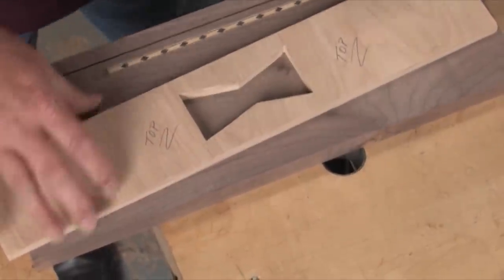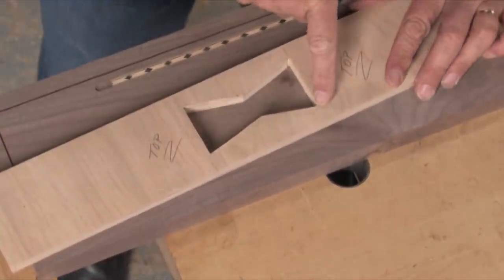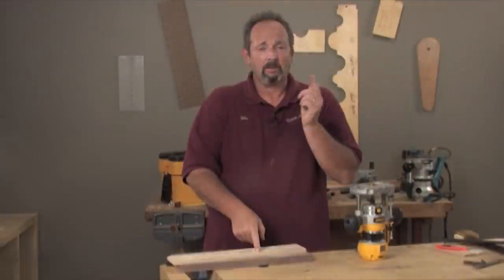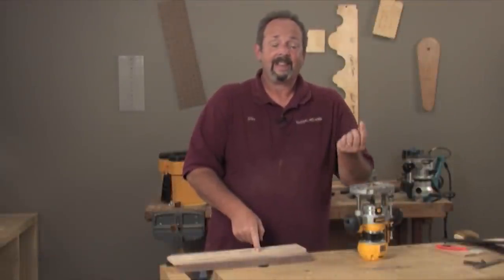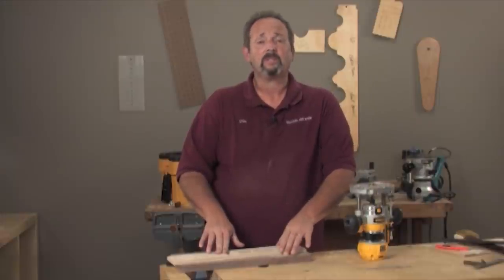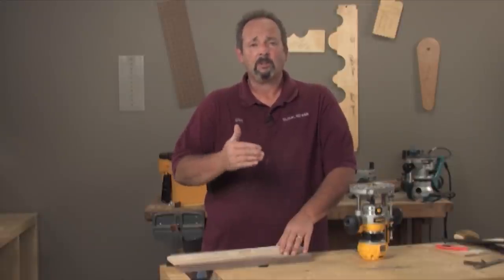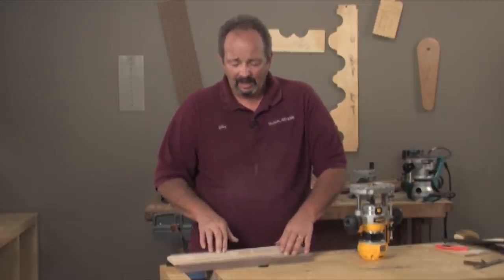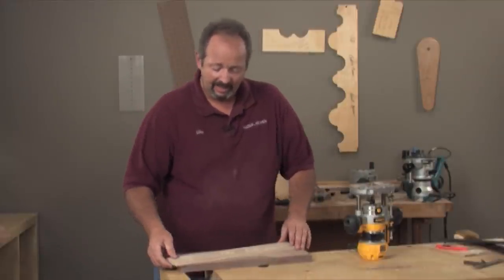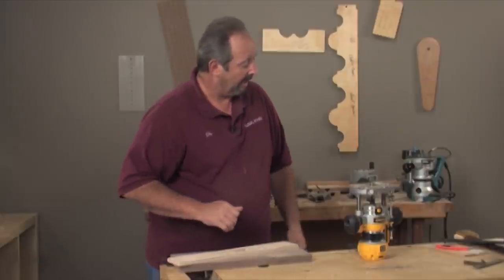I will caution you about outside corners. Although I have the pattern cut where it's nice and square, because of the roundness of the router bit, you're going to end up with a little radius right at the corner. That radius is fine in your pattern or in your work surface piece. But when you get to the inlay piece, you'll have to take some sandpaper and just round those corners off ever so slightly, and that will allow it to fit in. As far as a pattern goes, anything you want to use will be something that you can inlay.